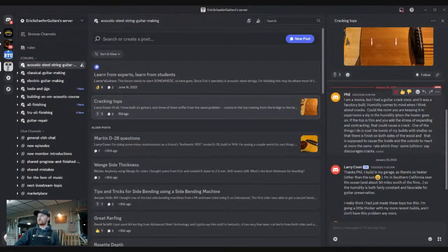Okay, so that's absolutely correct. What causes things to crack more so than expansion and contraction sometimes is what he's talking about, which is the difference between expansion and contraction on one surface as opposed to another, because then you're causing stress to the wood. When you leave, actually, I have a piece of wood right here. When you get a cup like this, see how that's cupped? The only reason that's cupped is not simply because the room dried out, but because this surface dried out more or at a faster rate than this surface.